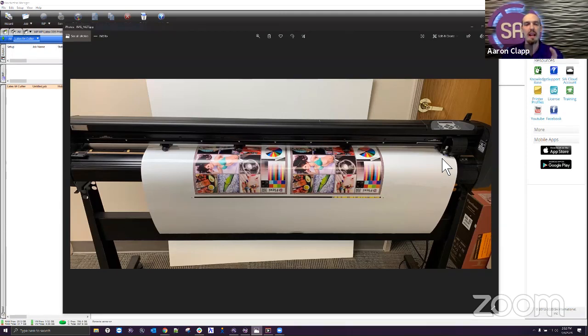Also, I just wanted to give you a quick preview here of this image again. Notice how I have plenty of space in the front. Now this is, in fact, a little excessive, but the reality is our printer has an issue where it tends to jam if you don't feed a bunch of material through it. So I went ahead and just fed a bunch, but make sure that there is a good amount of material up front here so that there's enough for the material to grab onto and there's enough room. So 3-4 inches should be sufficient. And again, you could probably test a little bit to see how close you can get that.